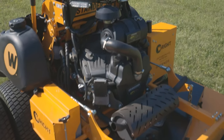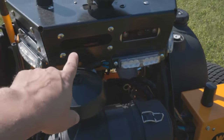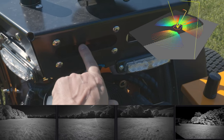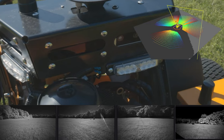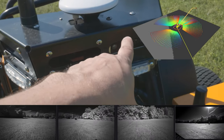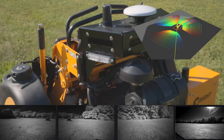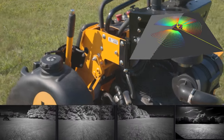On the front we've got some of our sensors. There are four cameras — one on the front with two eyes seeing infrared, and a projector that gives a dot cloud so the machine can create a map of everything in front of it. It also has an RGB camera in there, and there are four total: one front, one each side, one in the back. This front camera is a stereo-based camera that does object recognition — it classifies objects like cones.